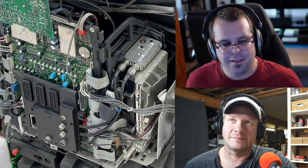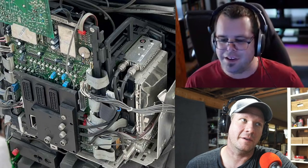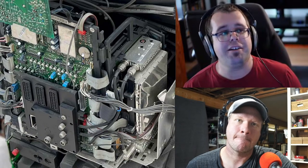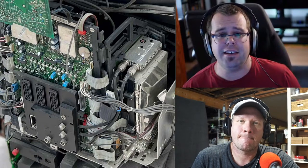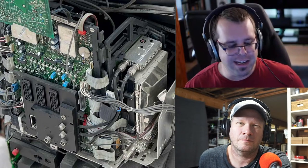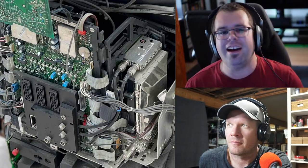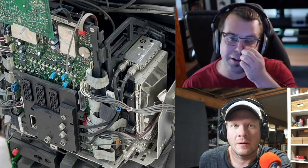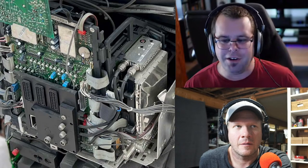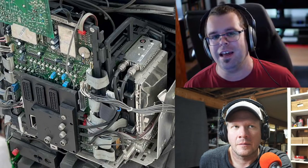All right. So, they're notorious for something called the timekeeper chip. Have you heard about this thing? No, I've not. You can explain it. Basically, the CDI has a battery backup installed on the motherboard, and that battery is what saves the settings and your save games, and the CDI itself requires this to function correctly. Here's the thing, that battery is inside of an integrated circuit. So there's a chip with the battery inside. It's actually inside the chip along with other components. What's the solution? Well, you could desolder it and put a new timekeeper in, but guess what? That specific IC is old, and any of the ones that you find are likely going to also be old, and that battery is going to be dead.